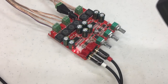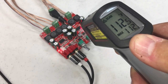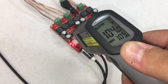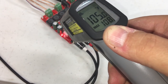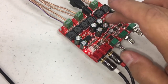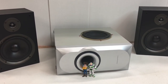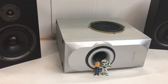About 30 minutes in, we're going to check out the temperature of the chips. The sub channel is at 112 degrees and the front channel is at 105 to 107 degrees Fahrenheit — not too bad. They could probably still stand heat sinks, but they're not that hot to the touch. I was playing it really loud, jamming to some YouTube tunes. The sound quality won't fully come through YouTube due to recompression, but I can tell you it sounds pretty dang good.